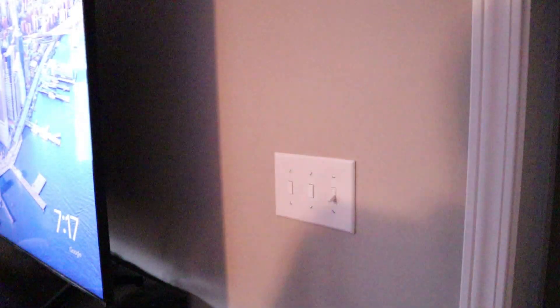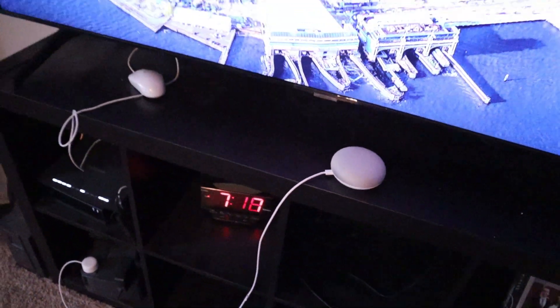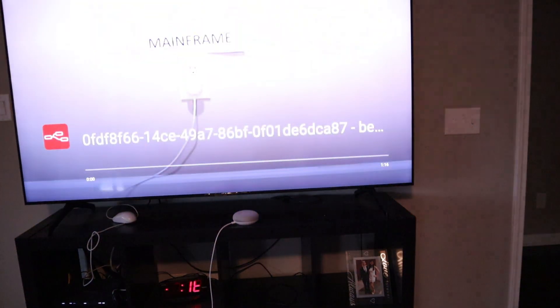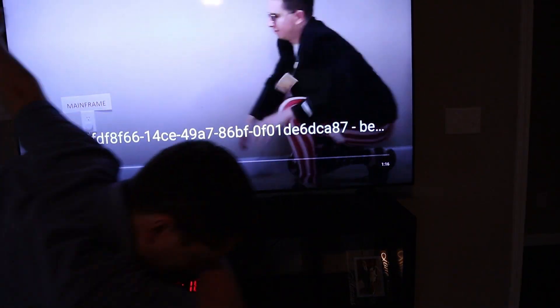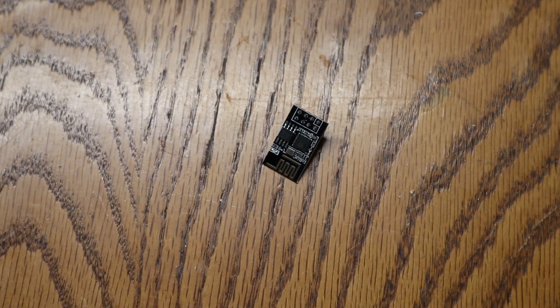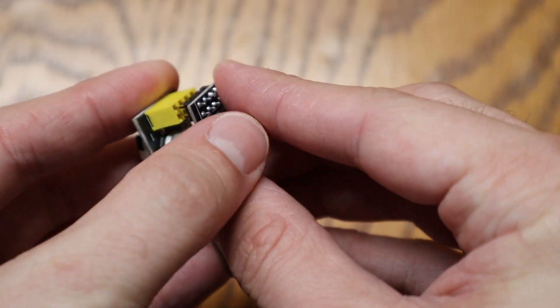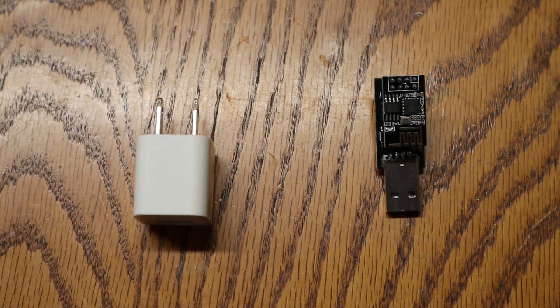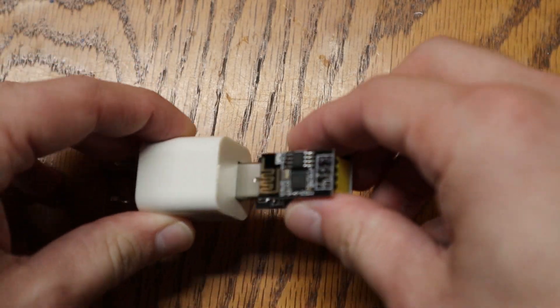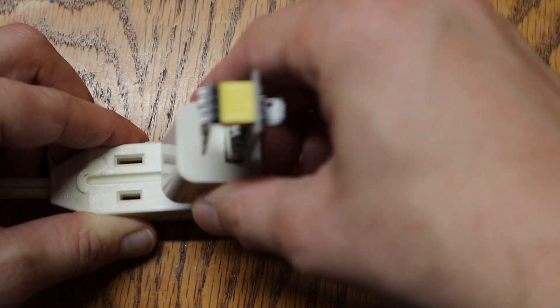Hello Noah. I see you're trying to show off to guests again — let me help with that. And to bring it full circle, the Hacker Stick. This is an ESP8266 programmed with ESPHome, just like the light buttons. On power on, Home Assistant is programmed to do whatever. Using a USB wall wart and the programmer, the ESP8266 powers on — it does take about five seconds to boot.